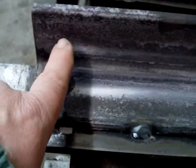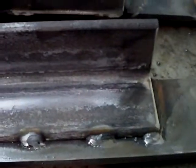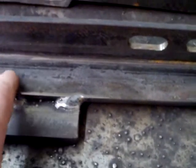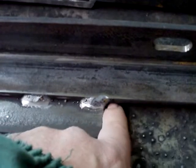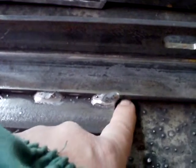This part gets one hole drilled into it and then it's finished. This space is for another cross member under the bed — there's no bolt in that, so I can't put a nut there. The reason there's another part on top of this is because there's an obstruction on top of the frame, about a quarter inch tall. The part is three-eighths of an inch, so you should have a sixteenth of an inch clearance when this goes into the other part.